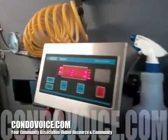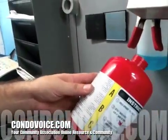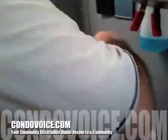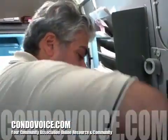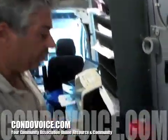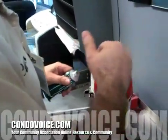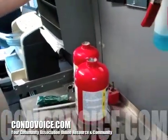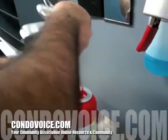Eight pounds — good deal. Now we're going to pressurize the fire extinguisher with nitrogen at 195 pounds. Why nitrogen? Nitrogen is dry — it has no moisture. Compressed air has moisture which will clog the powder and the extinguisher won't discharge properly. The jelly on there is the same lube used for the valve stem, so it doesn't dry out.